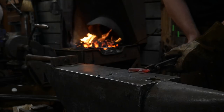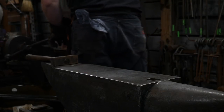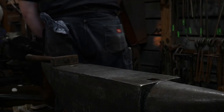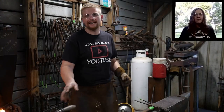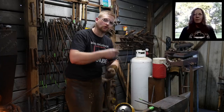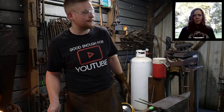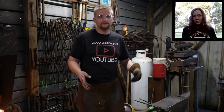Bill Miller: 30-pound hammer, you'll just need Samson to swing that thing. Yikes. How many strikers will you need to forge that monster? Don't know yet. For strikers, something about that size, you could get away with two people easy. It looks like a monster, but it's not really that bad when you're swinging sledges at it full bore. Unlike a lot of hammering work done with a striker, which is very controlled, with billets this big it's swing for the fences, as fast and as hard as you can, with as heavy a hammer as you can possibly swing. That's the concept behind doing it with striking.